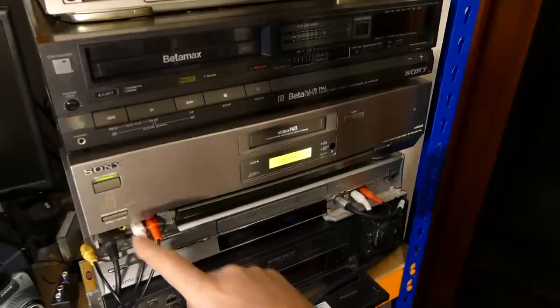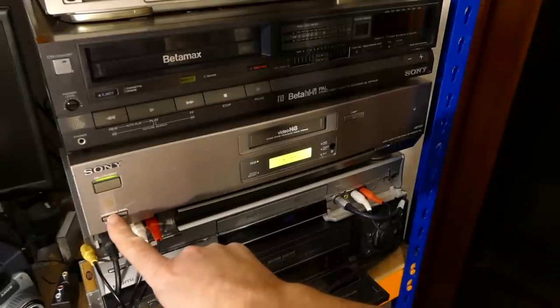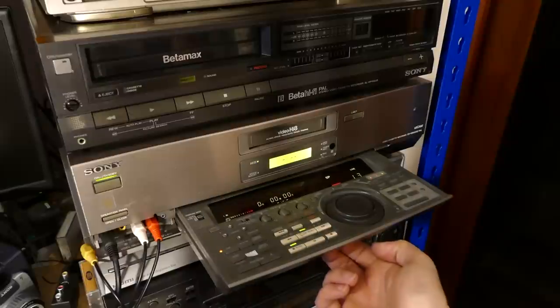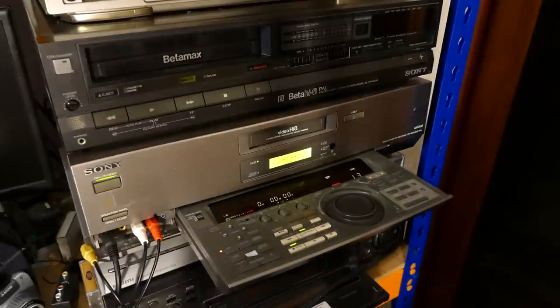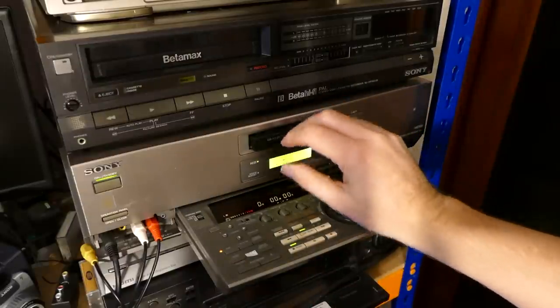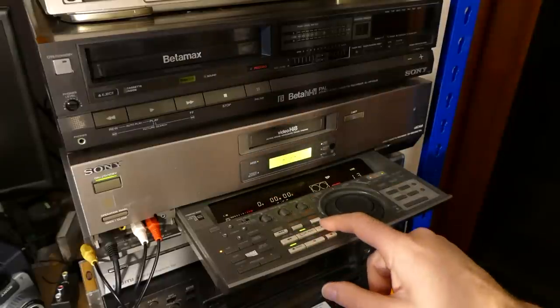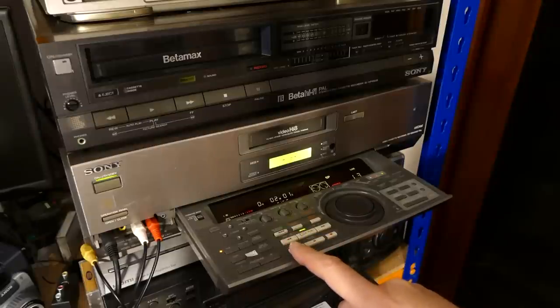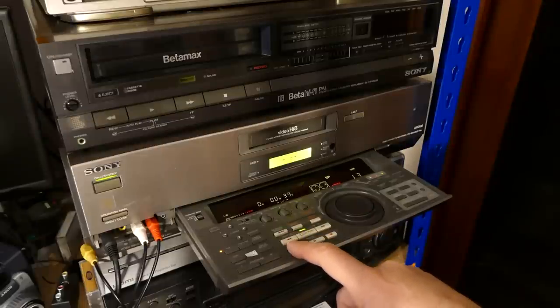This is not the same machine, but another in my fleet, and it has several problems. Firstly, and rather cosmetically, the control panel does not slide out properly. It usually requires a bit of a tug to get it started. Now, let's put in the tape and press fast forward. You can hear a regular ticking noise from the mechanism, and after a few seconds it aborts. We will rewind the tape a little to reduce the chance of damage. You can hear the ticking noise during eject too.